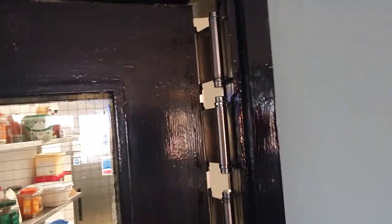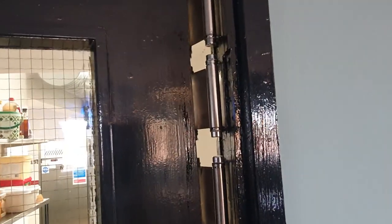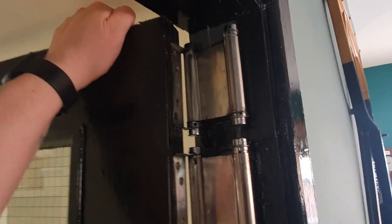I've removed the spring tensioners from the other side - they're basically just this little rod and hole assembly. You pull it back, take the rod out, and then this will rotate to loosen it off. As you can see, it's taken all the slack off the door, so the door obviously won't close unless we push it upwards to take that weight back. As it opens that way that's not a problem, but at some point these hinges will fall forwards again.